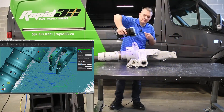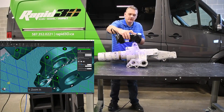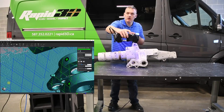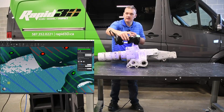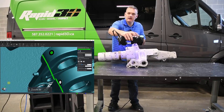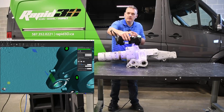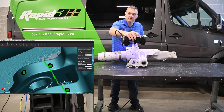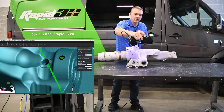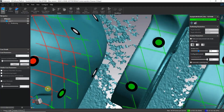We also have a single line laser functionality, which allows the laser to be seen by only one or the other camera — it doesn't have to be seen by both. So in circumstances where I have a tight area like we see here, I can double-click the scan button to get to the single line laser mode, and you see that data that wasn't filling in before is now filling in fairly nicely. It's something we simply use in tight areas where we can't get the triangulation from both cameras to the center laser to work.